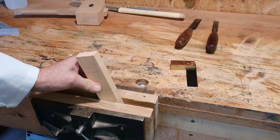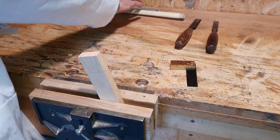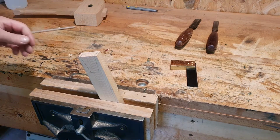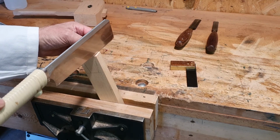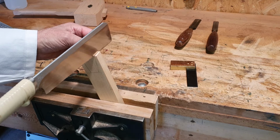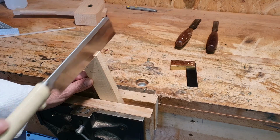Place the workpiece in the vise with the dovetail lines vertical, saw across the top and down to the shoulder line. Do this for all the dovetail lines. Always remember to finish with a horizontal cut so that you remove the high spot in the middle of your cuts.